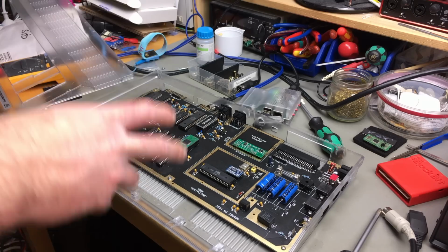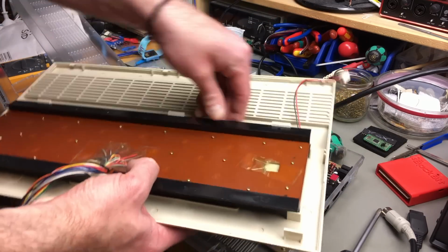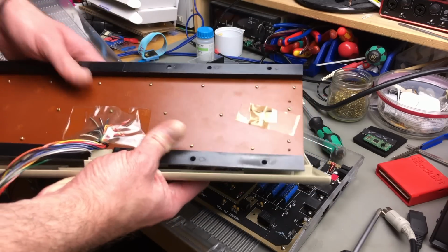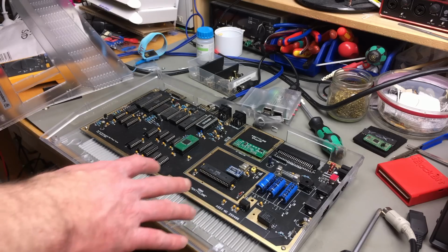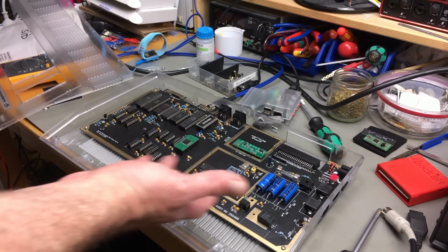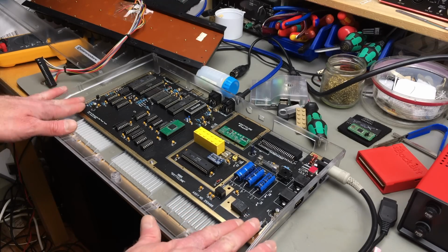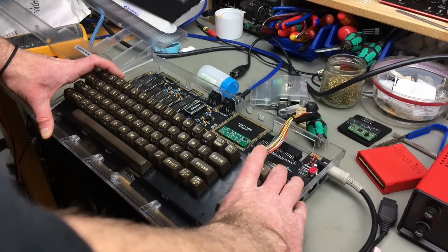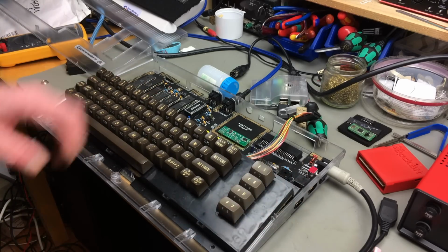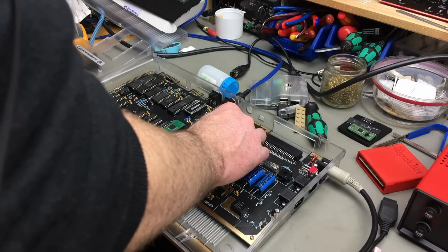I like it. So considering the keyboard and the LED, I'm just going to take them from this machine. There's actually several things to replace the keyboard. There are new keycaps. There was an Indiegogo campaign that started ages ago and got delayed quite a bit because, obvious reasons, the pandemic was happening. For these Commodore 64C cases, you actually need little standoffs where the keyboard sits on and gets screwed to. I know I have some 3D printed ones somewhere, but I can't find them at the moment. So I came up with this workaround, just stole some Lego bricks, and I'm going to put them here temporarily until I can find the proper standoffs.